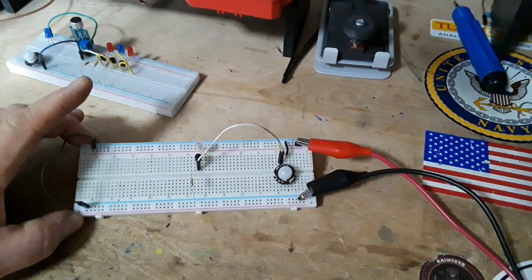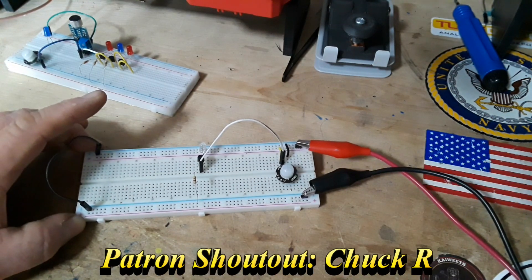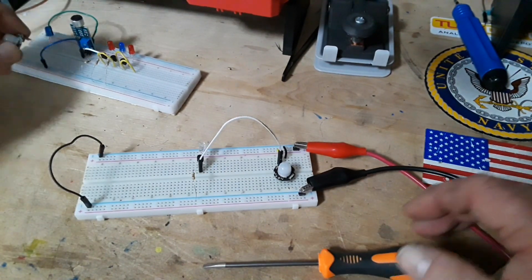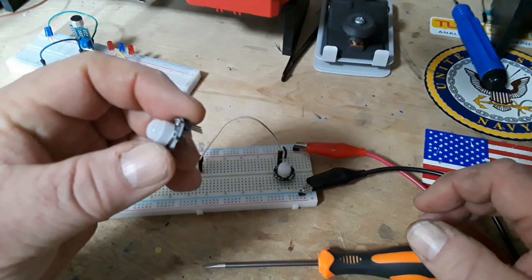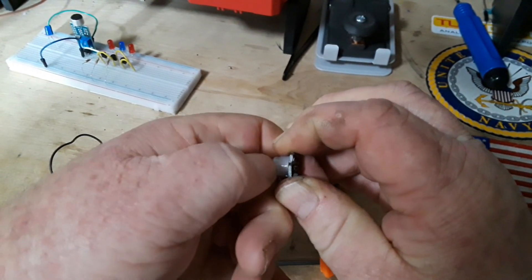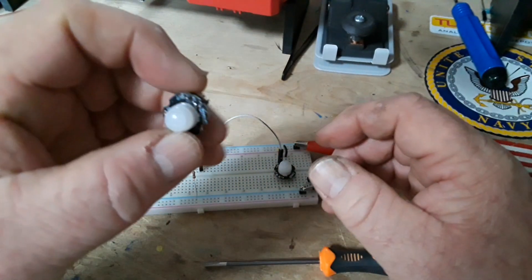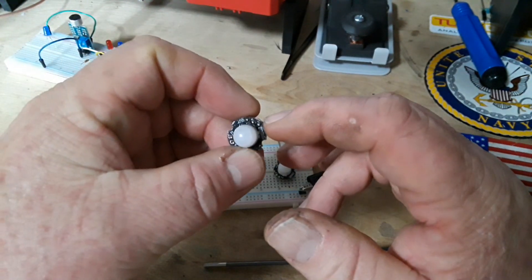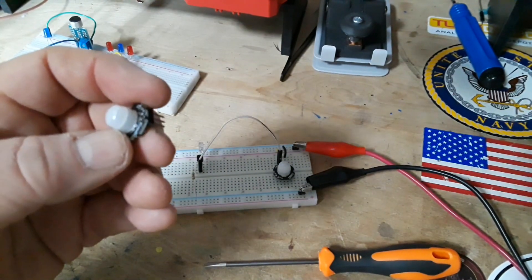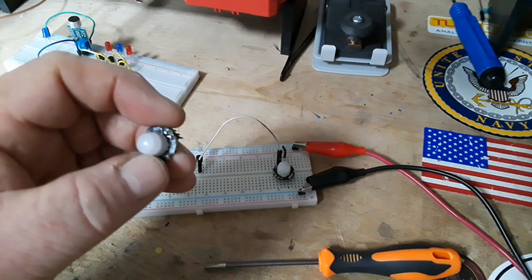So here it is. This is probably about the simplest way to do it — I say about because there's probably somebody out there who can think of a simpler way, but this is the simplest way I could think of. What I got here is a motion sensor. You can buy these really cheaply off of Aliexpress, Amazon, or eBay. This is just a diffuser and there's a sensor under there that senses your presence. They have three pins — this one is negative, positive, and the output. If you don't buy these, you could salvage this little sensor from dollar store motion-sensing outdoor lights and things like that.